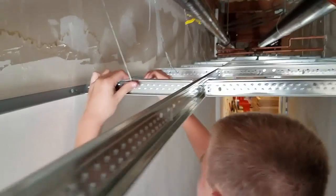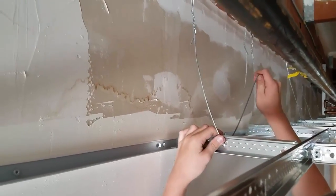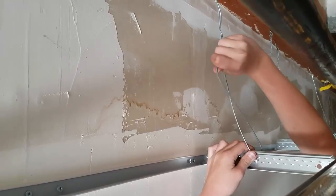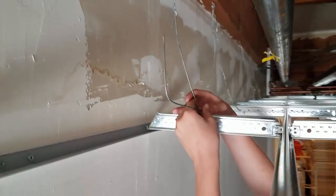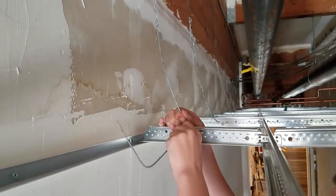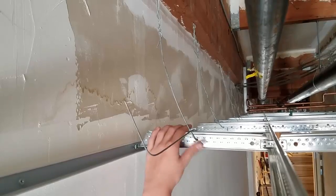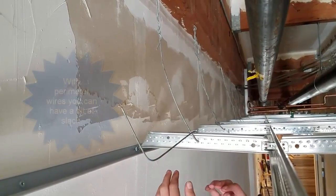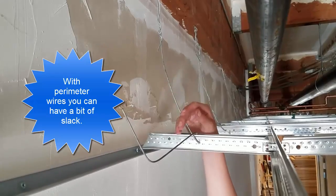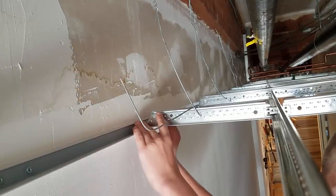You want to bend so you have something to grab onto, and then pull it up through here. Make it nice and tight. You want to get it close to the wire — don't copy me on not getting it close to the wire. If it's filling up like this, you didn't have enough slack on it because it needs to be down here and up here. Make sure that you have slack on the wire.